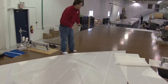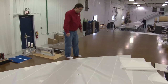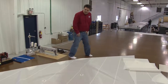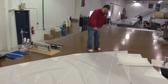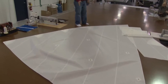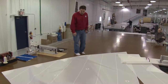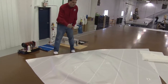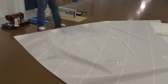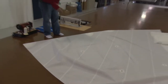Now for small boats like this it doesn't matter as much. But think in terms of a sail that would stretch the entire length of this table — all of a sudden that becomes very important, otherwise your stitch quality starts to go down. You're starting to see the shape built into the sail; it won't lay completely flat on the floor because of those curves we saw earlier when we were looking at individual panels. That's also why it's important to put the lines on the sails for things like reef point marks, because once you have shape in place, it's harder to figure out what a straight line across the sail is because the draft gets in the way.